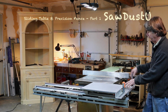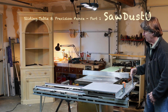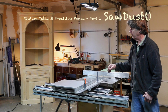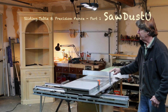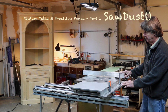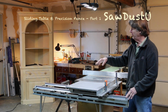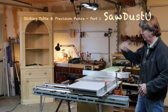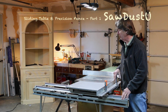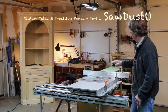I've got this set up. I've got about 26 inches from the front of my blade to my fence. And of course, you have to have it set up so your stroke goes all the way through the blade. But the nice thing about this system I came up with is you can, depending on the lengths of these rails you put on your platform, you could have this come 3 or 4 feet in front of the saw blade and of course go the equivalent distance on the other side of the blade. Very nice system. Same thing with the fence.